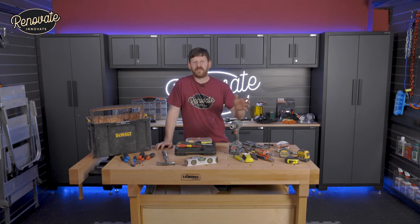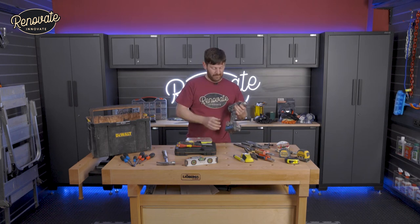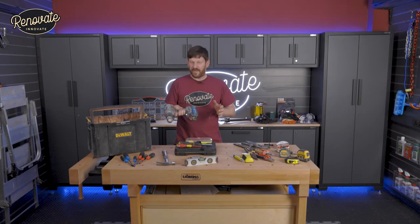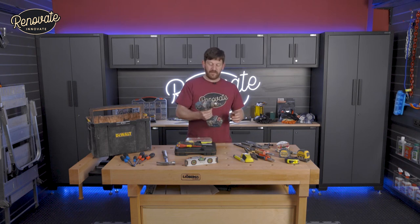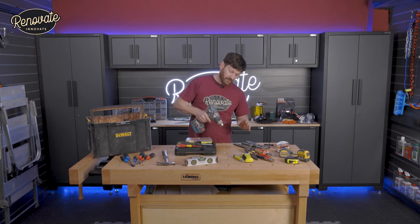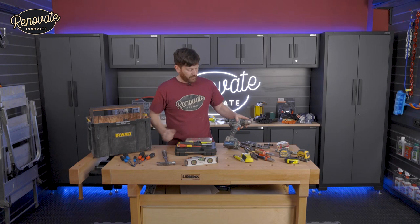Putting up a shelf or a sign on the front of your house — at some point soon you're going to need to drill into a wall: plasterboard, brick, or block wall. You might not know what kind of wall it is, but you need a drill that can deal with all of those things. This is an 18-volt drill running on a 4-amp battery, which is a big battery — not necessary to start with. For DIY you can go down to a 12-volt drill with a smaller body, easy to handle especially when working above your head. It has settings for the amount of torque, and also a hammer function, a drill function, and a screwdriver function. Get a good quality drill — you don't want it slipping into the wrong mode when you're using it.